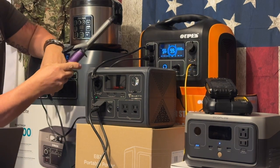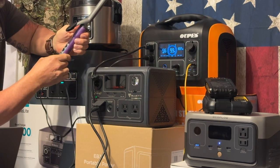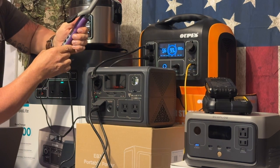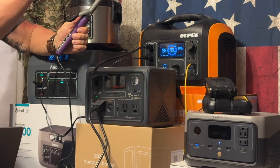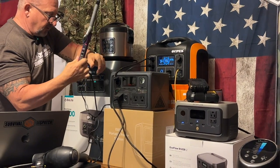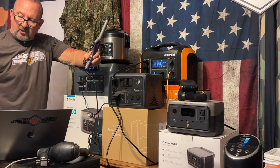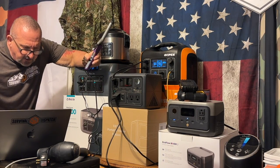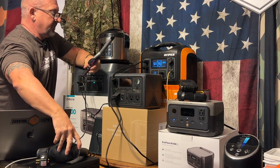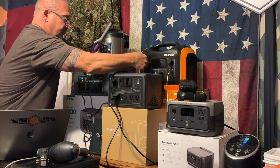So we've got the curling iron set back up to 400 degrees Fahrenheit. Looks like we're going to settle at a 1,082 watt draw. So we could plug in the fan, the DeWalt, and run all those devices simultaneously. It definitely isn't going to do the next jump up, which is our vacuum cleaner here, which is 1440 watts, and then after that this blow dryer is 1875. So let's unplug these guys.